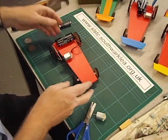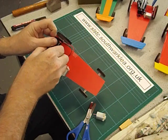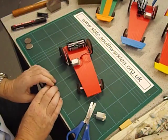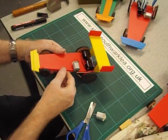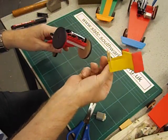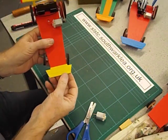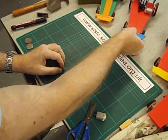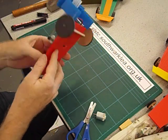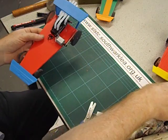That's your basic racer. Let's see if it bursts into life — yes, there we go, they are very fast! At this point I would encourage pupils to do some designing and add some features to their racer. On this one I've got a rear spoiler wing made of 4mm Correx with some bits of dowel, simply pushed into the back so you still have access to the battery. I've got a wing at the front as well. On this one we've got some bendy straws for exhaust pipes. I made this one a little bit wider because I was experimenting with the batteries around a different way, but it's harder to get the batteries in and out, so I've gone back to having the batteries the original way.